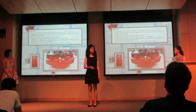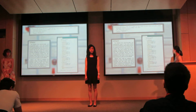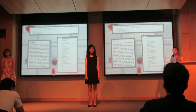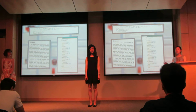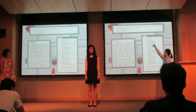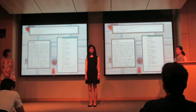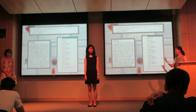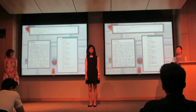And then this is how the code allows it to do that. So on the Arduino Uno microcontroller, we programmed it using C. As you can see here, this is part of our code. So we imported the IR remote library and the password library. So the IR remote, when you press it, each button sends out a different signal, and it'll go through this algorithm, and then depending on which case, it'll do a different set of actions. And for the password, you have to enter a password to start using your robot. And the Scribbler 2 robot was programmed using Python, and we imported the Myro library so we can control its motors and its IR sensors and its eye sensors.